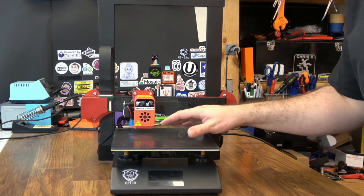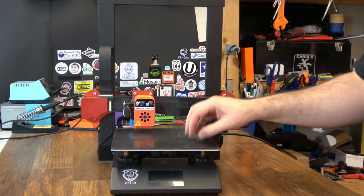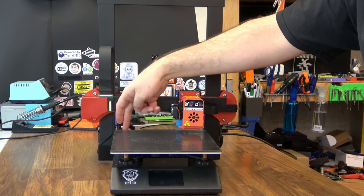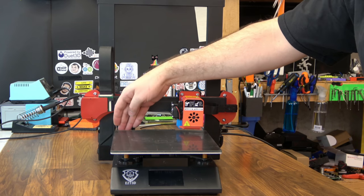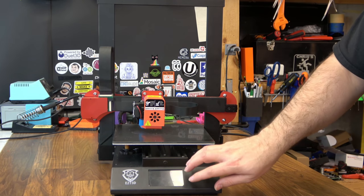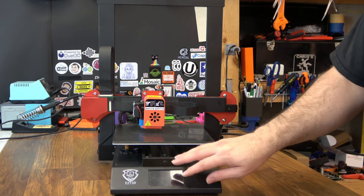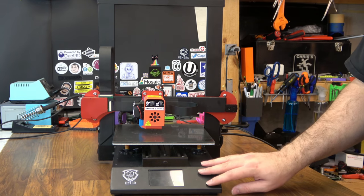All in all, this is a fair 3D printer. The adhesive on the bed I just found was kind of an eye-opener — I'll make sure they know about that. There are also some concerns about cable strain relief on the bed; that shouldn't be moving freely, we need something solid to tie that to. I've also run into a few firmware bugs, especially when trying to resume a print after power-off and when the filament runs out. But I'm hoping all of that will be resolved by the time backers start getting their machines.